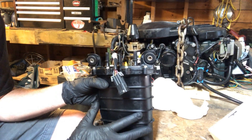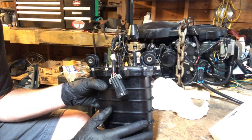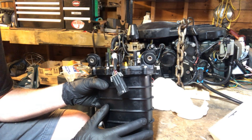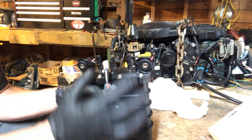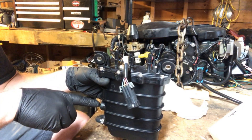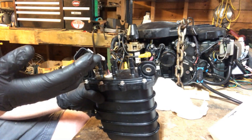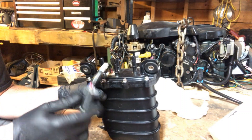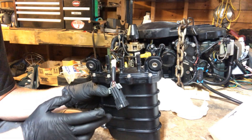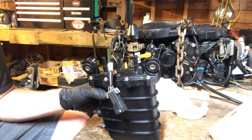It's at the front side of your engine. I was hanging off the front or back of a pontoon boat pulling this off, that's why I didn't have the camera going. Basically it's just your cooling water lines, your fuel lines, vent line, and then the power harness for the high pressure pump and low pressure pump on this side.